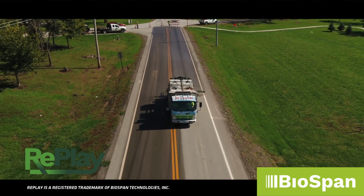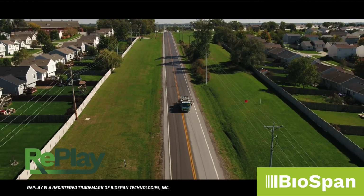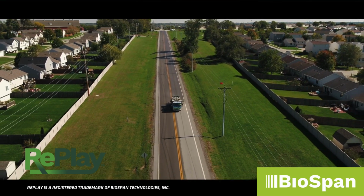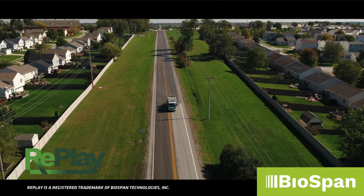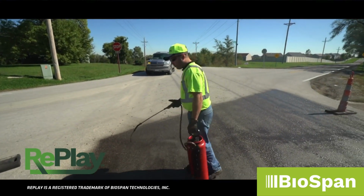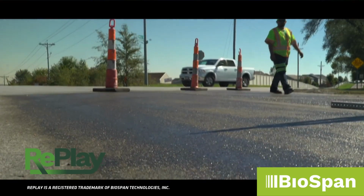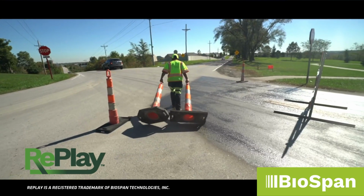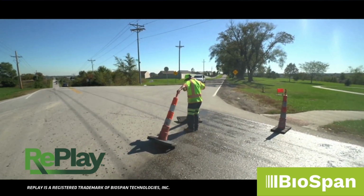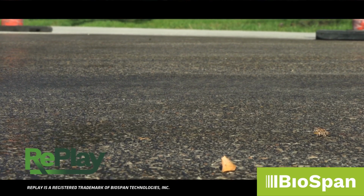It did. The RePlay-treated sections performed slightly better than the untreated sections, showing greater resistance to crack initiation and progression. Wow. But that's just the tip of the iceberg. They also used a dynamic shear rheometer to analyze how the asphalt binder, the glue that holds everything together, was holding up over time. Okay, I'm intrigued. Tell me more about this rheological analysis and what they learned about the binder. Well, rheological properties just means how a material behaves under different conditions, like heat and pressure. Got it. And the dynamic shear rheometer measures specific properties of the binder, like its stiffness and elasticity.